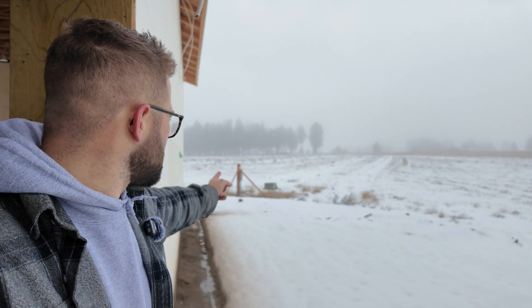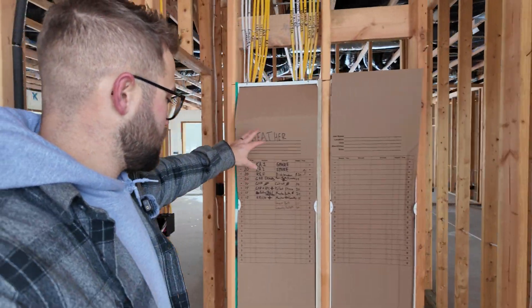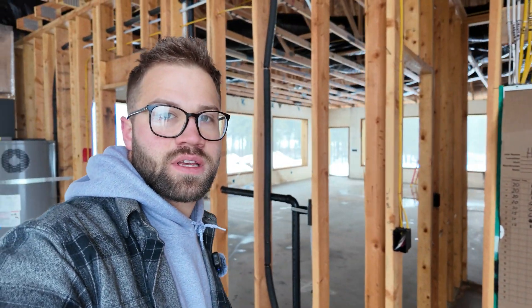To start with the electrical — the electrical comes in right there. We're going to run it underground and into the garage. When it gets into the garage on this wall, we're going to run it up and over to these panels right here. We have a 400-amp service to this house, so we have two main panels and we're just going to balance everything out across them. There are two ways to accomplish this, and the way we're going about it, we're just going to drill a core hole through the wall. We could do a sleeve, but one core hole through this wall is all we need, then run it right up the wall and over to these boxes.